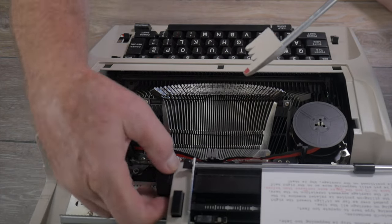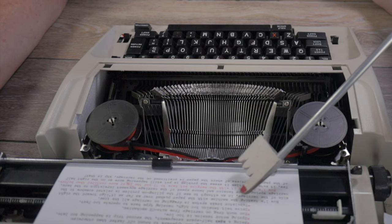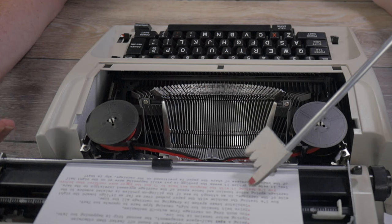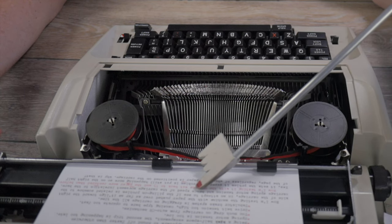Finally, this machine has a tabulator brake system — a very good brake system — and another brainstorm idea is that the tabulator brake might be dragging all the time, slowing down the movement of the carriage a little bit. So those are all the possible causes for the intermittent piling on of letters.